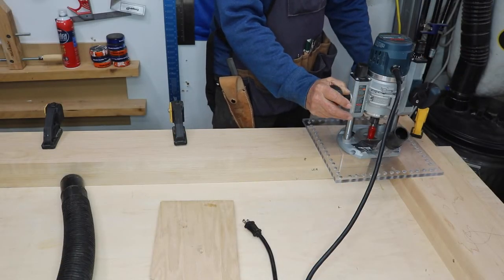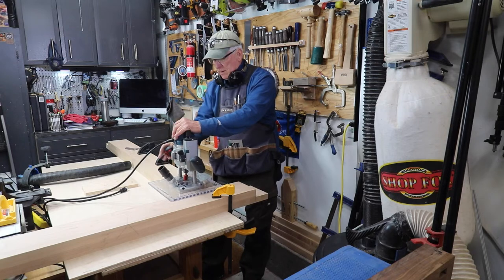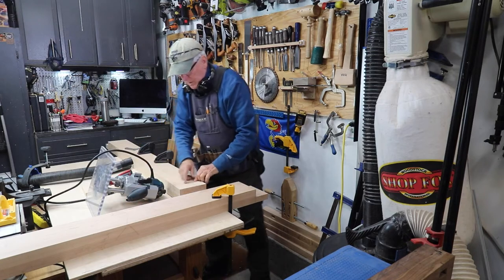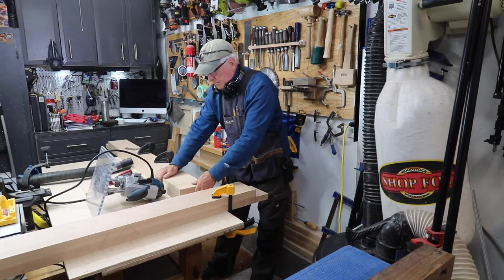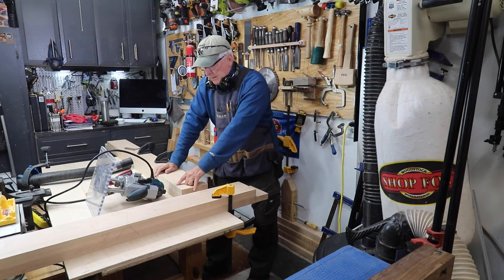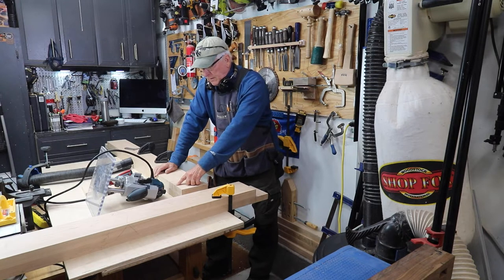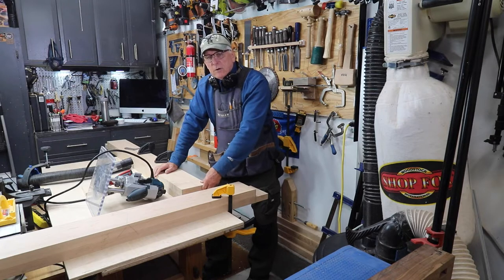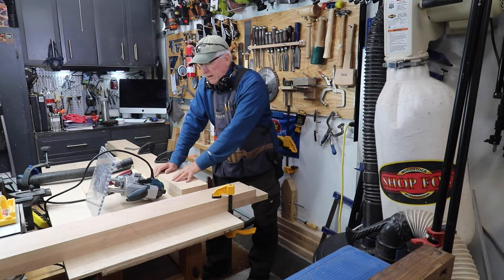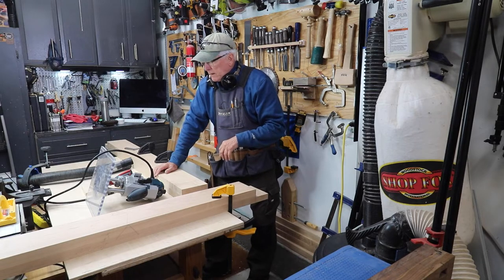I like to keep this router level, so I like to have a second workpiece to secure it on the outside. I want a limit on how far my router goes into the workpiece, because I only want the router to come up to this line. I want the distance between this line and the line at the other end to be very precise. Going over it would be hard to fix, but leaving it too short means a lot of chiseling. So I try to creep up to that line with all my setup so I can use the router to cut it precisely — it cuts much nicer than hand chiseling.